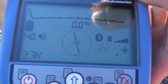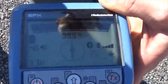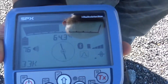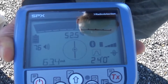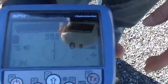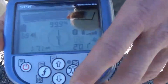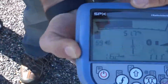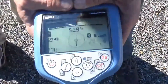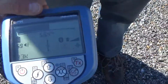As I start to scan to look for that signal, whenever the sensitivity gets too strong, we turn our sensitivity down — one button push balances that sensitivity. As I keep coming, the signal gets stronger again, and we keep repeating that process. Until the signal drops out on the other side, climbs up, then drops out. That's what we call a peak response.